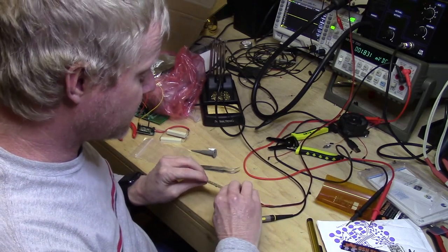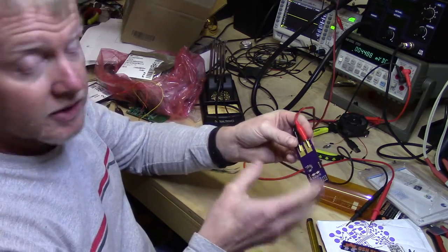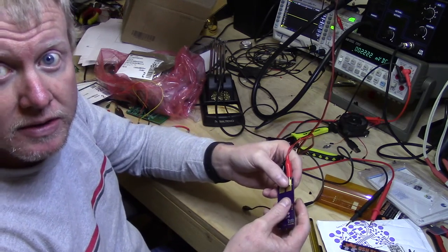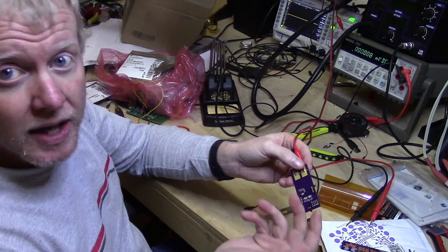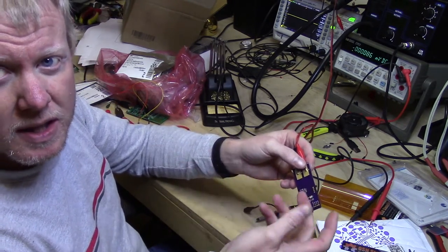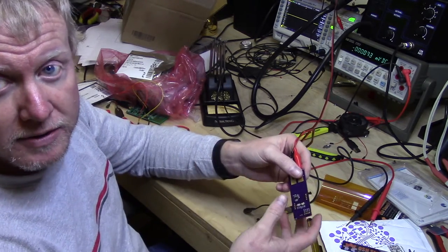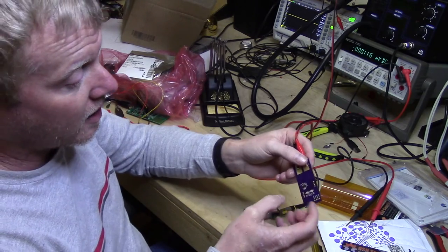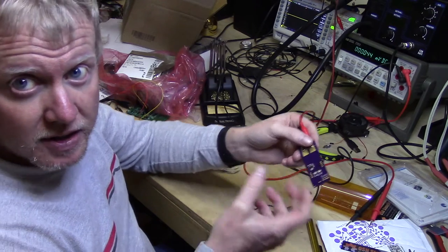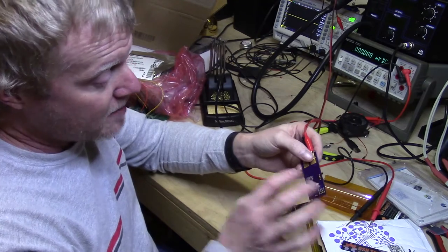In prototyping something, at this kind of stage you generally want to bring up power rails first if you possibly can. Now, a lot of boards on really complex designs you can't really do that. And typically I don't, because I'm using either an existing known design or something like TI's Power Wizard. They've already pre-built a lot of these modules and everybody knows that they work. You do still need to check them to make sure that you didn't make a mistake, but the likelihood of it actually failing out the gate is very low. So I'm happy with this.